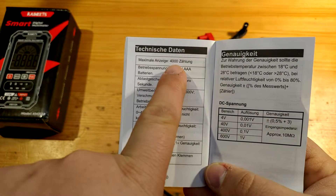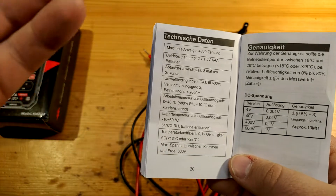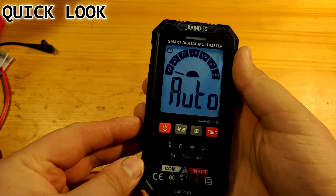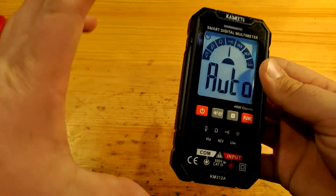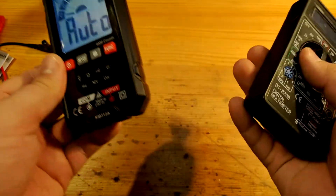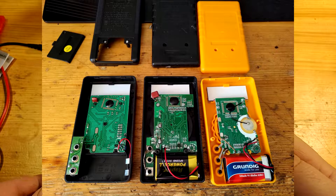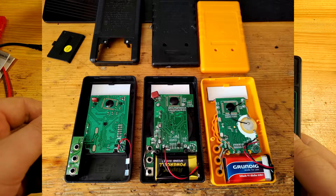The display has 4000 counts, showing a maximum of 3999. Continuity test reacts below 50 ohms — that's a really smart decision. This tiny multimeter is really small, so it can fit any pocket. I would say it is perfect for little humans, sometimes called children. It has dimensions of 65 x 126 mm, so it's the same size as the classic DT830. Those used to be good basic multimeters, but only used to be — not anymore, as manufacturing quality has declined significantly.